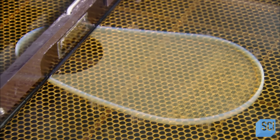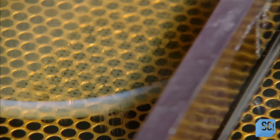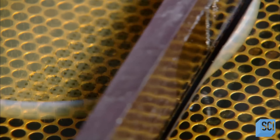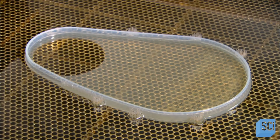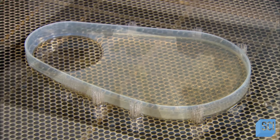The computer model guides a stereolithography machine to produce a plastic prototype of each engine component. The machine repeatedly outputs paper-thin layers of photosensitive liquid resin, which an ultraviolet laser instantly solidifies.